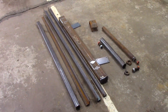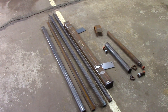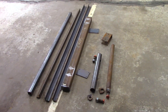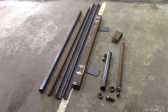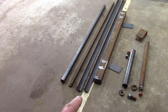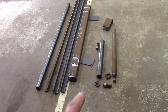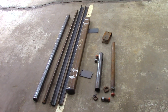These will be permanently mounted, but that requires making a mount — I want to mount them to the side of the shed and be able to tilt and rotate them, because in wintertime you need to readjust the angle. Going through the shed, here's what I've come up with: some quarter inch angle iron, heavy wall inch and a half square tubing, eighth inch two by three flat stock, some pipe, and miscellaneous bolts and parts.